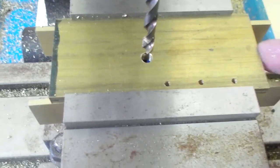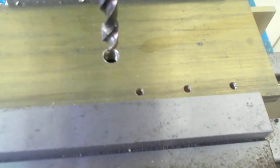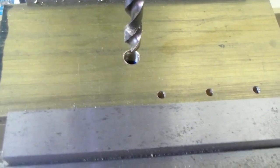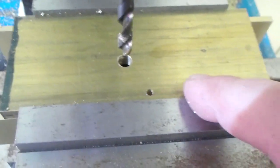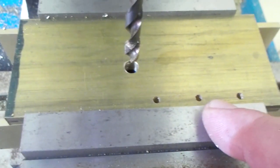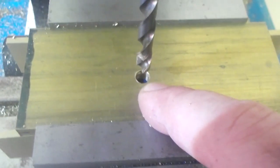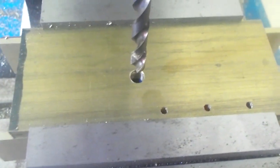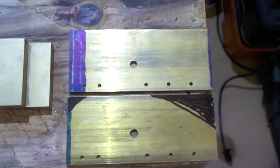Cleaned up the sides, got them to length. I left it in the vise - make it a lot easier on yourself. You're going to drill both holes at the same time: three for the rear, two for the front, and then a quarter inch for the cap dowel pin. These are reamed to one-eighth inch or just under - that'll take our pins to hold the sides to the sole. No need to ream the quarter inch - the dowel we're actually going to sand down to be a couple thou under so it fits in there and then it gets peened. Holes all drilled.